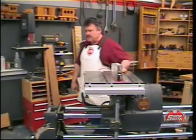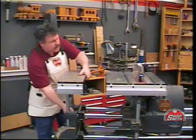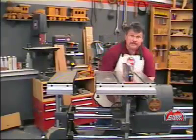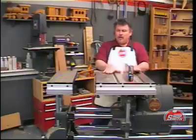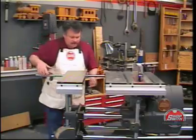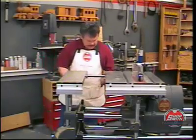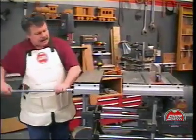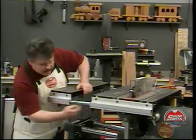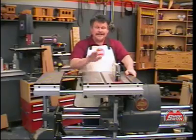All you need to do is take your auxiliary table and put it in your base or your headstock. Adjust your main table to whatever depth of cut you need, and also adjust the miter gauge and the fence while you're at it. As soon as you've got the table positioned where you know you're going to use it, take an extension tube and put it through the auxiliary table and into the main table. Take down the locking knobs and then do it again so that you have the tables tied together at both the front and the back. And look at this — the wiggle is all gone and you can get dead-on accuracy out of this now.